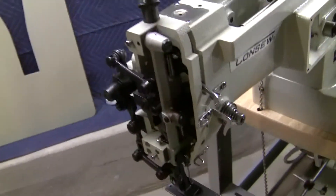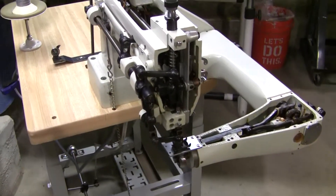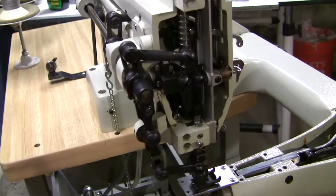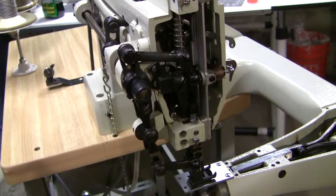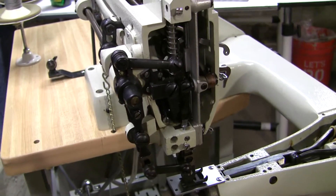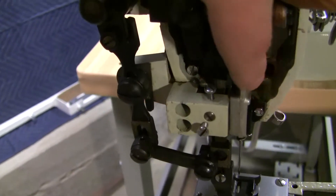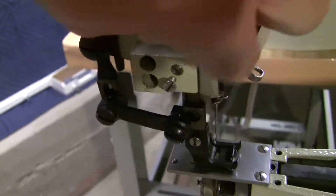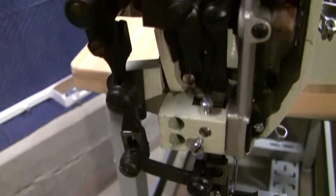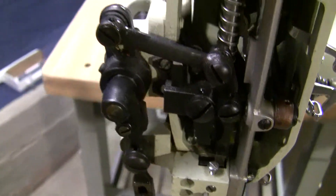There's just a ton of levers on this thing. You can see it's not really like a regular one — it's got a lot of external levers on it. On a regular walking foot, a lot of this stuff will be inside. But with the zigzag, this needle right here actually moves back and forth. It'll go up and down and then it'll go back and forth this way with another lever that's right here. This lever pushes it back and forth and that's all adjustable too.